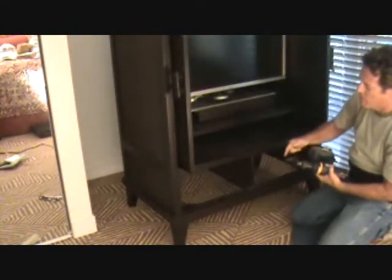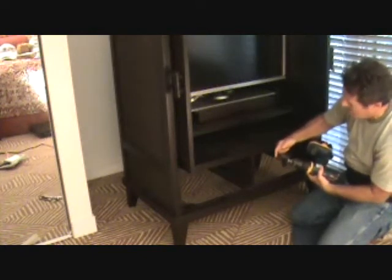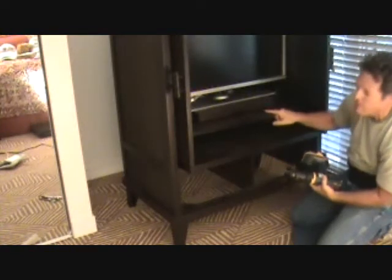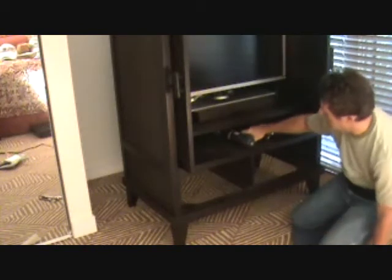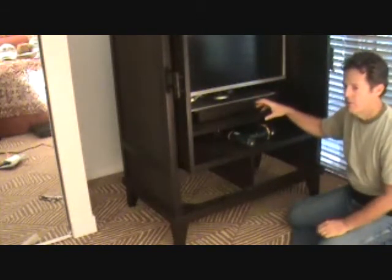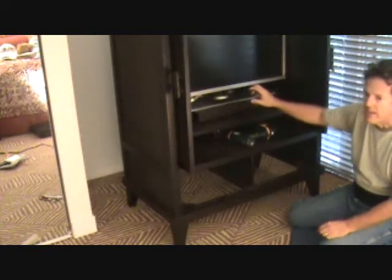Okay, once I start drilling my hole, I only want to go down so far. I want the tip of the hole saw, just the middle drill bit, to go all the way through. Once I start drilling and see it from the other side, I'm going to go around on the back side and drill just a little bit there and score it, then come around on this side, or I can finish it on the back side, either way.